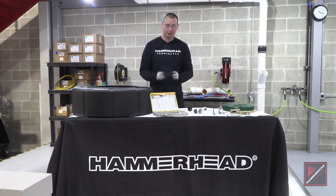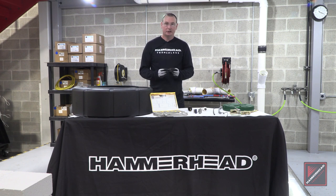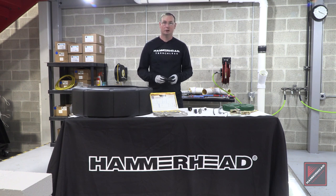The next item we have is our separation tube. The separation tube provides space between the blade and the bigger expander cone to divide the forces — the slitting force and the expanding force. The last item is this little expander cone. This expander cone acts similarly to the separation tube in that it adds a little more distance between that slitting and expanding force, but also does a little pre-expansion work so that when the pipe reaches the bigger expander it doesn't see as much load, meaning you need less pulling force to complete the pull.